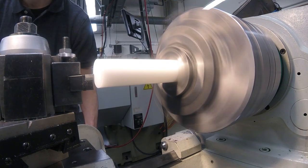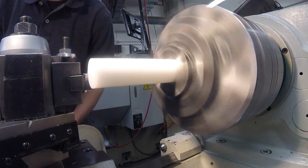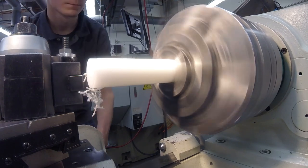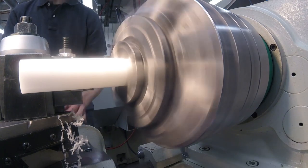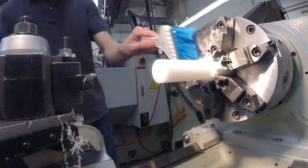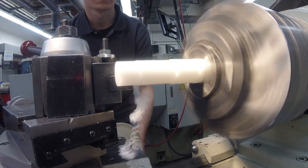Here I just touched off on the end of the stock to find the edge and set my Z zero, then took a first pass and set my Z to zero. I touched off on the diameter until a chip was formed and set my X position in the digital readout to the diameter, which was inch and a quarter. The first pass was pretty light, just to see how the material cut. The chips strung up on me a little bit, so I stopped the machine and pulled the chips off with a brush. Taking a little bit of a heavier cut this time, looks like about 50 thousandths.